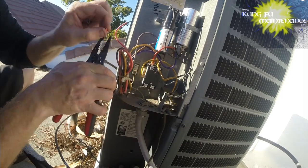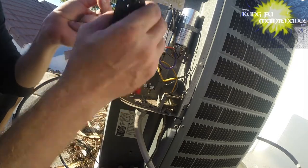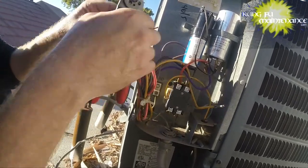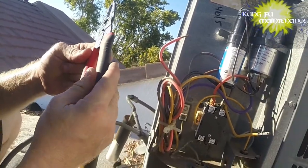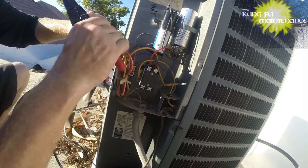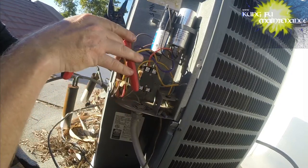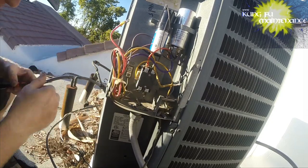You want to make sure you don't lose any strands — it becomes a place to build up heat, as you can see here. Probably going to fix this other one up too. Crimp on our connection. This is a really nice tool — it's a Gerber, but the Gerber's worn off. Now it's a GE. Nice crimp-on connection — it's got the yellow indicator, yellow and blue for the first spot here. It's a real nice tool, makes a nice solid crimp, it's not going to go anywhere. It makes a good connection and it doesn't build up heat.